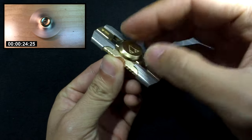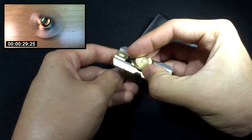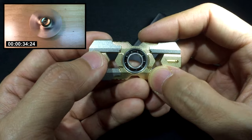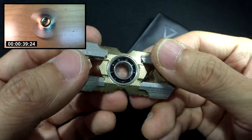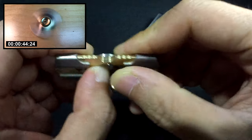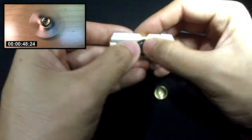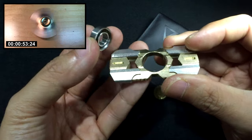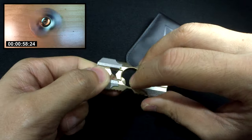Let's remove the buttons and I'll show you the bearing and the retention method. It is very simple — the bearing on this is a 688 bearing and it is a push fit or press fit. The funny thing is, I think because of the machining marks it goes in one way and comes out one way. There's no real actual lip but it just stops in place. It doesn't take a lot of pressure or effort to remove the bearing and pop it out, and by feeling the edges I don't even feel a lip on either end.